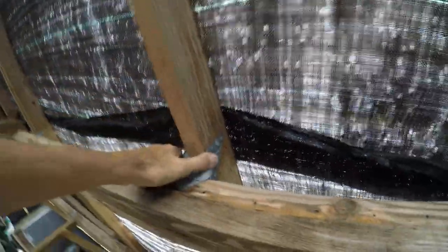Okay, so this rafter goes up. Cross member, 1, 2, 3, 4 screws, 3-inch screws, a Simpson tie, just plain screws. Okay, so this doubles up, triples up right here. Or actually quadruples, 1, 2, 3, 4, 4 2x4s.